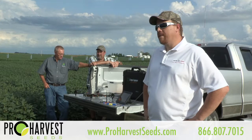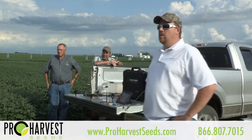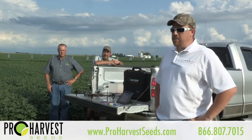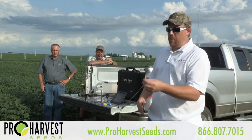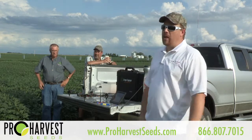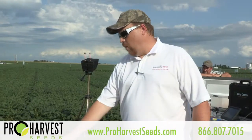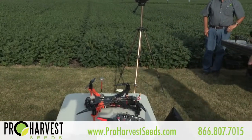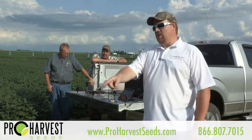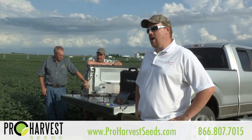A person, especially out here in the countryside, say he wanted Wi-Fi everywhere in this farm unit, could you put one up? Wi-Fi is bad. The reason being, Wi-Fi is also a 2.4 signal. Compared to the radio, where you're locking onto two signals, Wi-Fi is just a broad blast. Same thing with this. This is actually our video transmitter. This is what sends the video back to the screen. We run this on 5.8, so it doesn't interfere with the radio. There are 2.4 systems that will get you much more range on the video out to several miles, but you can't use them with these radio systems. You have to use a UHF radio system that, depending on which license you get, some of them do require a basic ham license to operate.